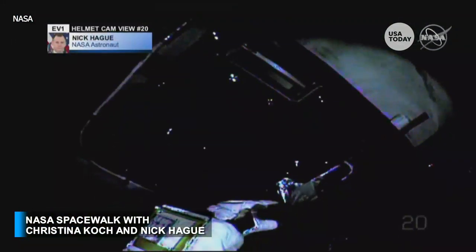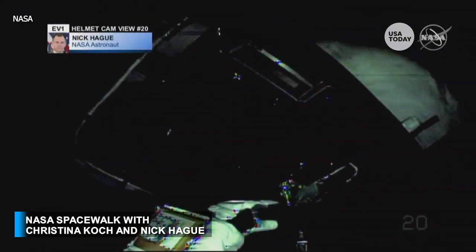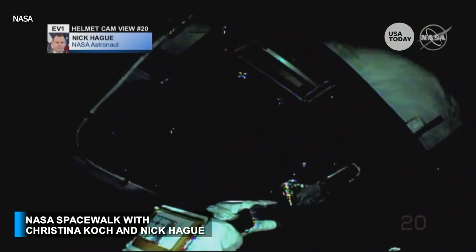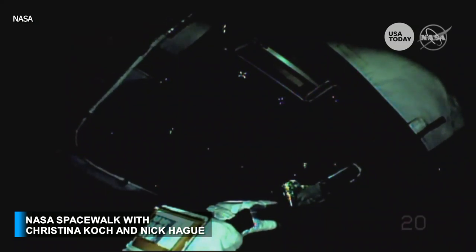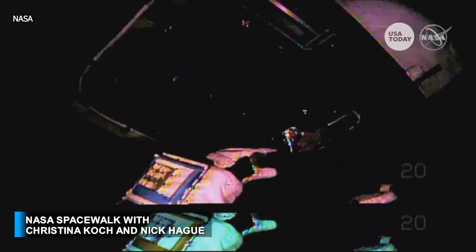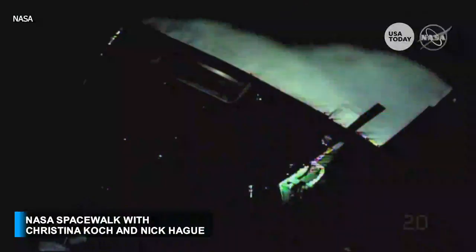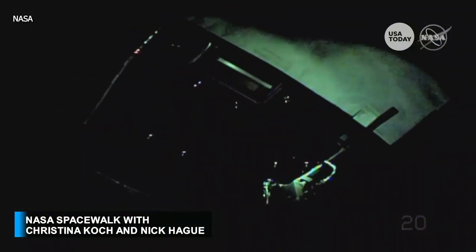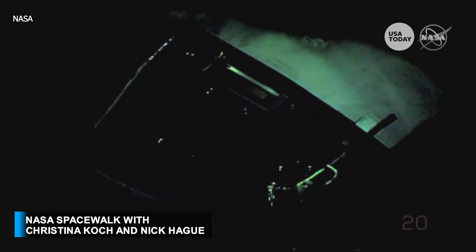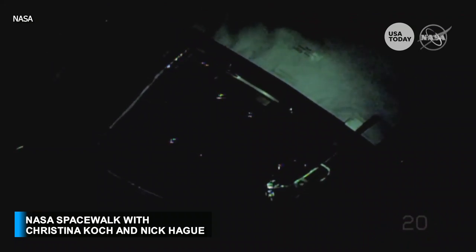After that, there will be some clamps to release that are holding the cable that they'll be installing down, and then a final... You could let go. There's still two reds holding it down. Okay, copy that. Final step is to mate the adapter plate cable to the new battery. That's a data cable that goes between the plate and the battery and provides battery insight. And I come to you. I'm going to be backing towards my safety cover so I can see it's not between the legs. Yep, it's a good config.